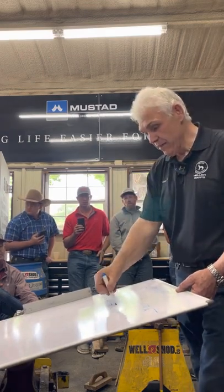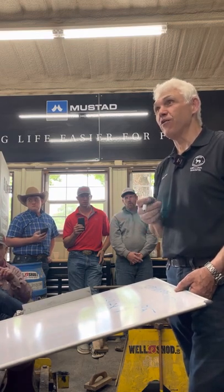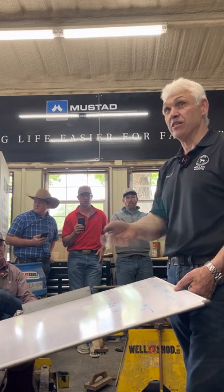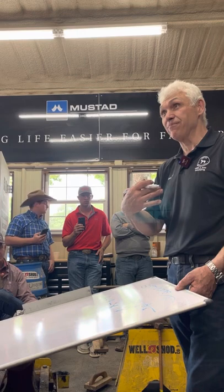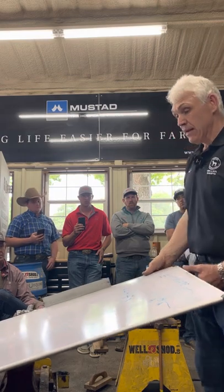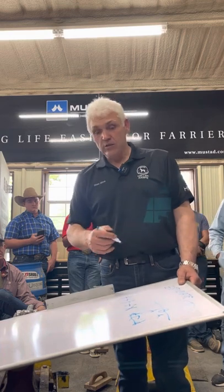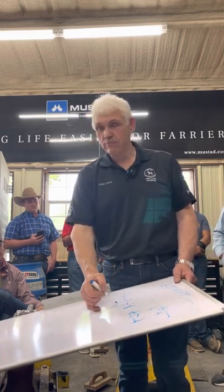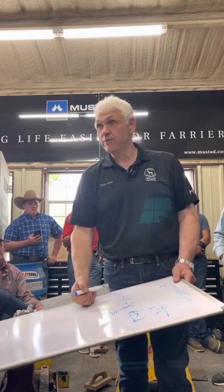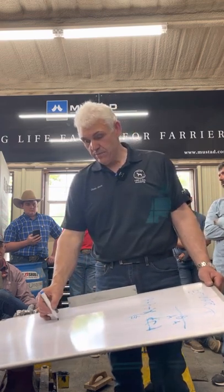So this number here, the X measurement, is a variable. If you're plain stamping, it's different to if you're fullering. If you fuller it, you're going to stretch those branches about 1/4 inch each, so you're going to take a 1/2 inch off what would be for a plain stamp. So all these things mean building an estimate. And then I take a C measurement, which is the width of the heels. So I take the two longest plus something, which would probably say 1.5 inches on average, plus the C measurement. So we come up with a gross figure of 14 inches.